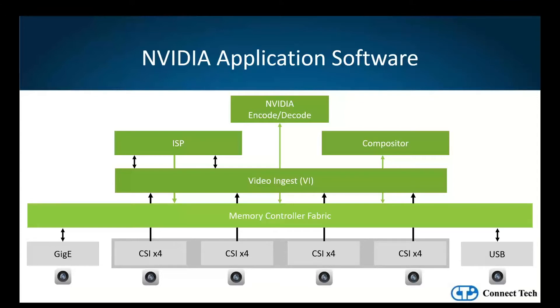From the video ingest side, every video stream ingested needs to eventually make its way to processing. One of the only protocols with direct access to the ISP tuning and processing on the Jetson platform is MIPI-CSI2. If you choose higher-level interfaces such as USB or Gigabit Ethernet vision to capture and ingest image data, pre-processing and transactions to and from memory are likely required, which can introduce additional latency. If you integrate a MIPI, GMSL, or FPD-Link camera, they allow for direct raw image processing and tuning via the ISP.